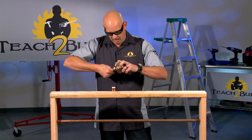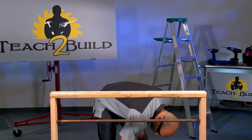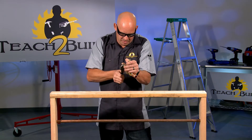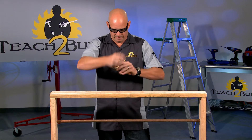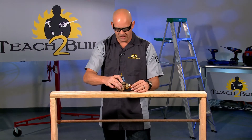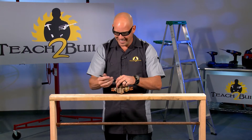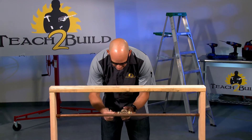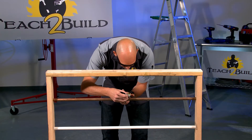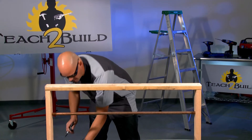Once these are screwed in properly, you'll need a wrench or two to get them tight. A couple of turns should be more than enough. Now you have to determine placement on your pipe. Once these fittings are in and tight, get your Sharpie out. You're going to want about a half an inch of penetration, which comes to the front of the fitting. Come into the front of the fitting and make a mark there and a mark there. Set this to the side so that we can get this pipe cut.